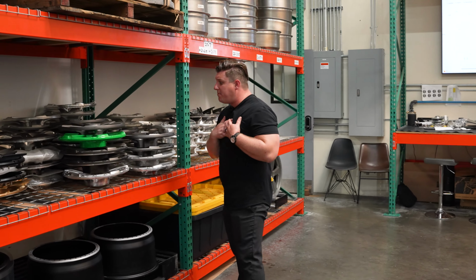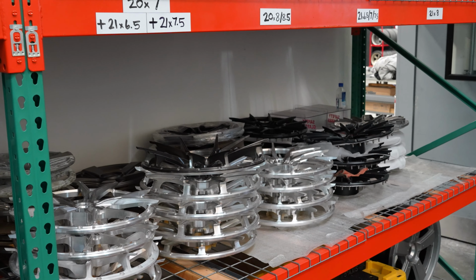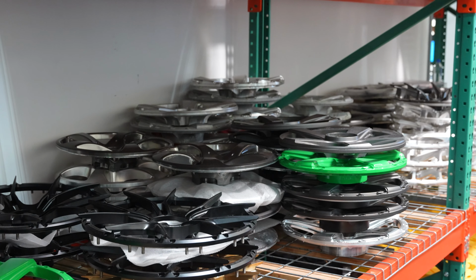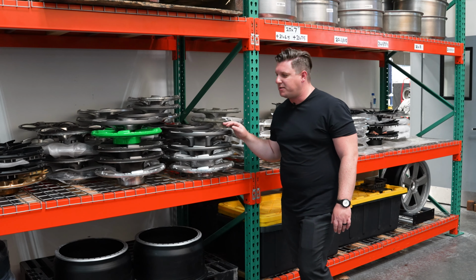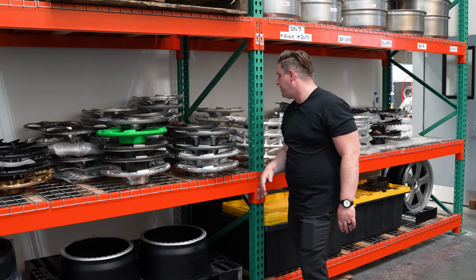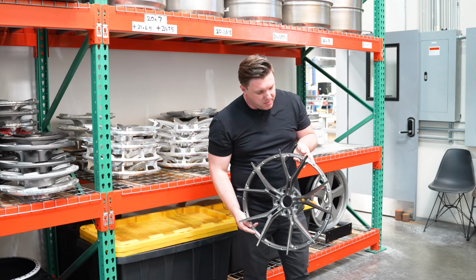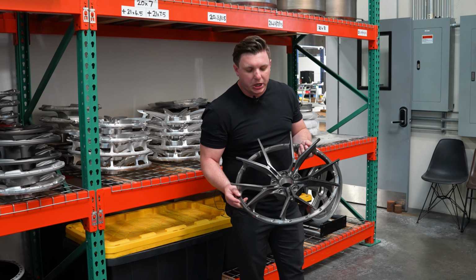In addition, like I'd mentioned, we do all the Guntherwerks wheels in-house as well. So all of those are all 6061 forged aluminum with aluminum barrels as well. We've got a couple different of our Fuchs design here. Graphite's one of the more popular finishes for our Fuchs, but here's a fun green finish. And then coming down, we also do brushed finishes. So this face has been completely brushed, and then we'll do a tinted clear coat on top of it.